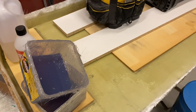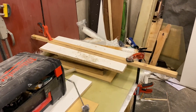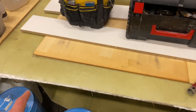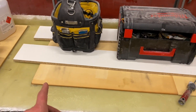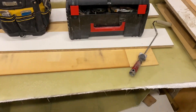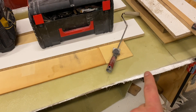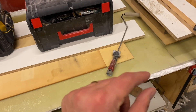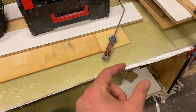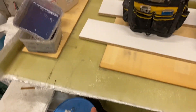I've also put in some Divinycell core, and you can see three different ways of stabilizing it — the one on the right is much better than the others. I've placed Divinycell only on three different parts: on the sides, which is where the swimming platform will rest on the bracket. I'll extend the sides a bit on top of the bracket to get a good bonding surface to glue the swimming platform to.